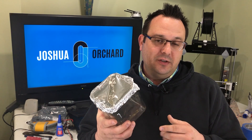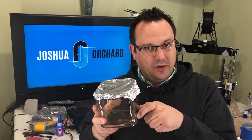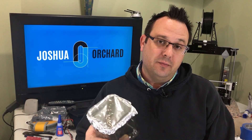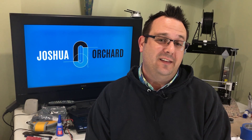I'm using a glass jar with a metal lid — I'll put some acetone in it with a little tray for the part to sit on so the part is not submerged, just in the vapor. I'll set it on my 3D printer with the heat bed turned on for maybe half an hour to 45 minutes to an hour. It's something I've never done myself but have seen done. Parts like the brake calipers, wheel hubs, and instrument panel details will be smoothed out quite a bit and look that much better.